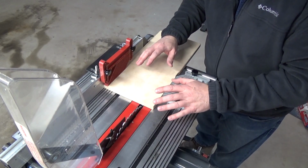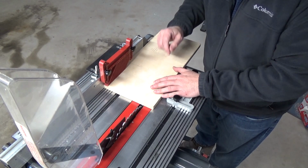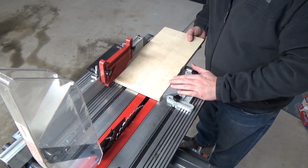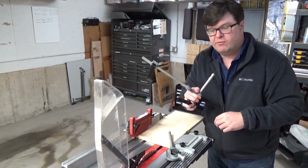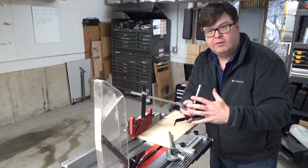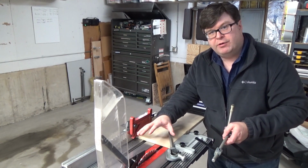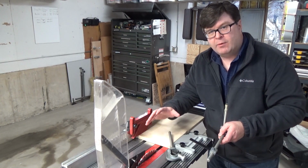The spring hold downs will provide all of those same features. The only feature that the spring hold down won't provide is the resistance to the backward motion if a kickback occurs. Admittedly, that's a pretty big feature missing from this system. On the other hand, if I have all my other safety equipment installed, a kickback is so unlikely to occur that I may not really need it.